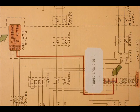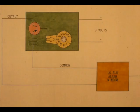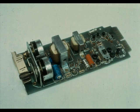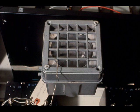Terminal 11C provides 1 to 5 volts for relay 5, chassis 251-2. This device is called a tripmatic. The tripmatic will allow a transistor operation at a predetermined value. For instance, if the tripmatic is set at 50%, a 3 volt signal will cause the transistor to turn on, producing an output voltage. This is the tripmatic card — the dial is the trip point. The transistor operation will cause a light to blink in a window on an alarm unit and will also cause an audible alarm.